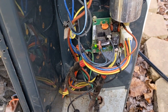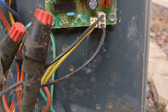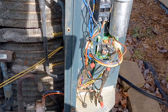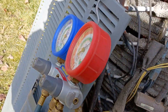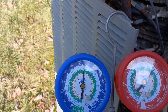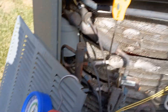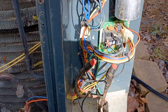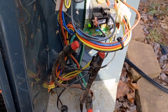What is going on guys? We're working on an R22 system here. You can see our pressures — we're running about 66 over 310, and it did warm up a little bit. We started out real cold but we're about 58-60 degrees out here. We're gonna do a little video on this Trane American Standard defrost system. This is the classic little green square board.